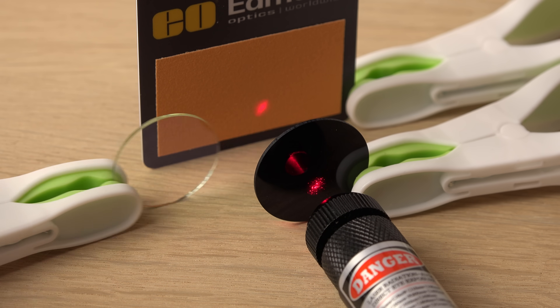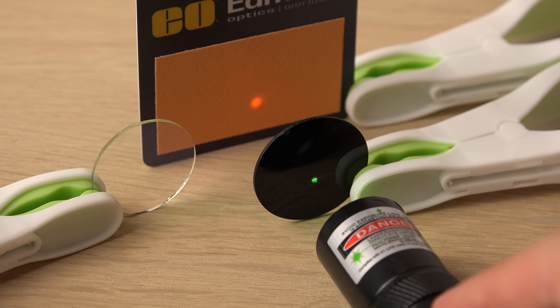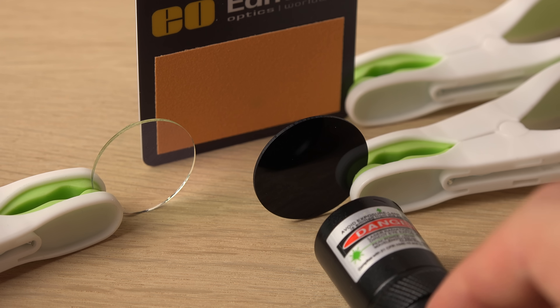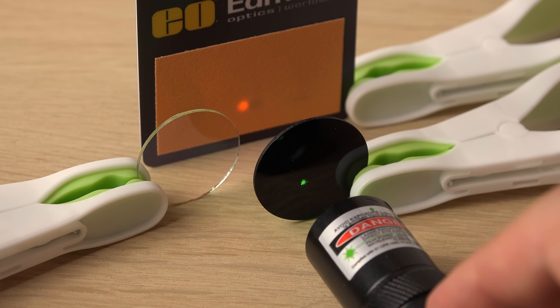Let's try the last of my cheap green lasers — also up to 50 milliwatts. Look at this ridiculous label: it says class 3A, but that class is only for lasers up to 5 milliwatts. Don't trust this laser to comply with any regulations even though it says so on the label. Not surprisingly, this one emits infrared too. It appears to be a very common issue with unbranded green lasers.